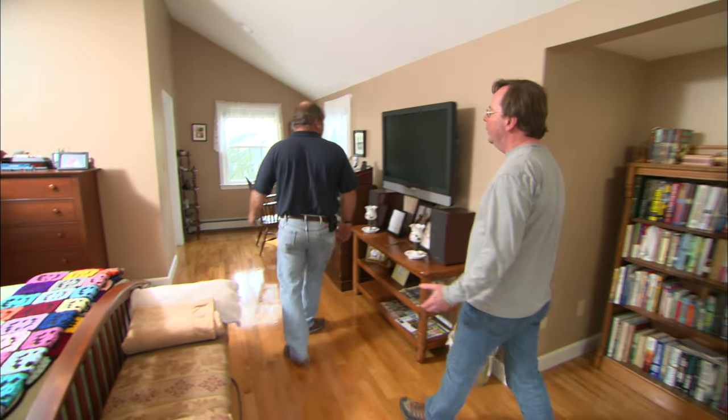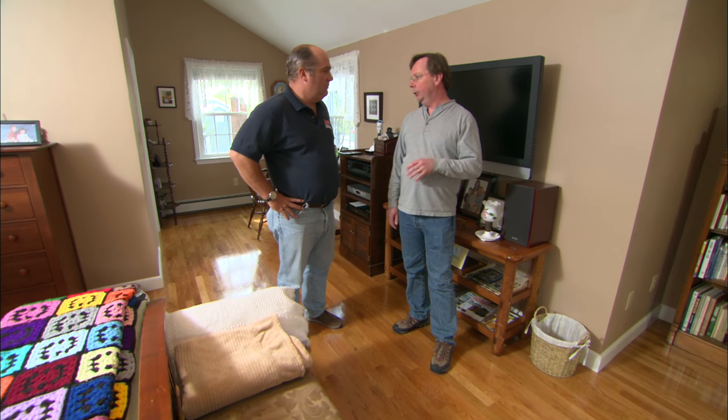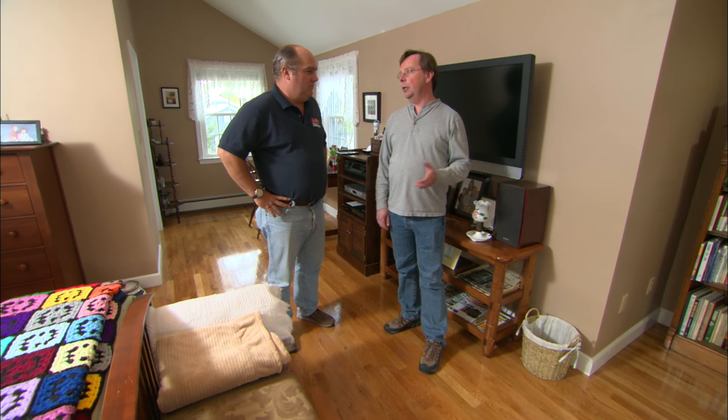So what's going on in here? Problems mostly at night time. When we basically close the door at night, the temperature swings in here huge. It goes from really hot to really cold. It doesn't seem like the thermostat is picking up the temperature in the bedroom. It isn't. The thermostat's in the wrong place — it's not in the bedroom.